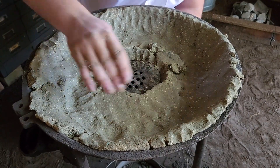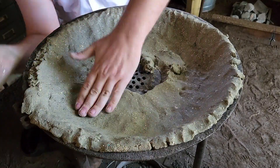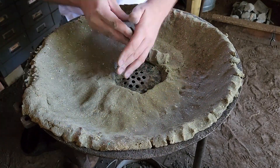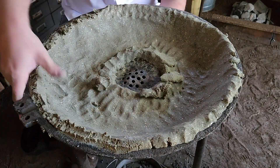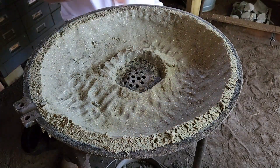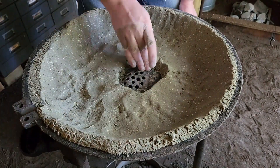You're going to keep forming. You want to make sure you're driving it heavy into the bottom of the pan. If the clay was a little firmer, you can actually use a mallet or a piece of wood to press it in there better. I'm trying to maintain a thick edge too — last time it was paper thin and it all cracked off on me, so I'm really trying to keep some width there.